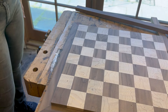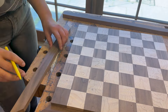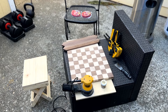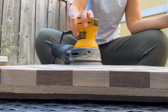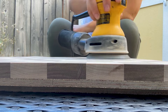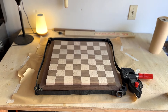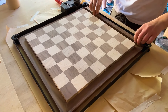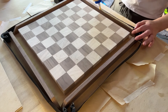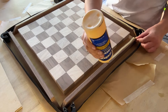As I cut the pieces, I kept checking to make sure they were all fitting together perfectly around the board and that there wasn't any gapping in the corners or other fit issues. Before gluing it all together, I did a few passes with my random orbital sander over both the trim pieces and the top of the board, slowly working up to 220 grit. Once that was done, I used a really handy clamping device I borrowed from my dad — a strap system with corner plastic pieces that you can add or remove tension to — to keep the corners in place while it dried. I'd recommend setting it up first and then taking off just a bit of tension so you can pull the pieces apart to lay down some glue.